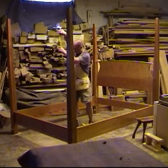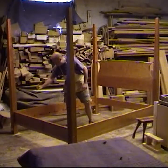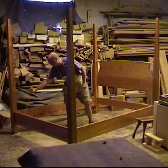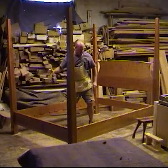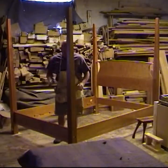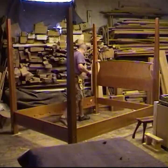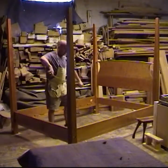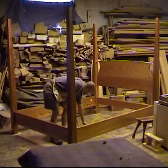One post corner, obviously from post to post, and what we want is a measurement of about 100 inches, which is 8 feet, 4 inches and 3/8 of an inch. So 100 inches and 3/8. Check that both ways.